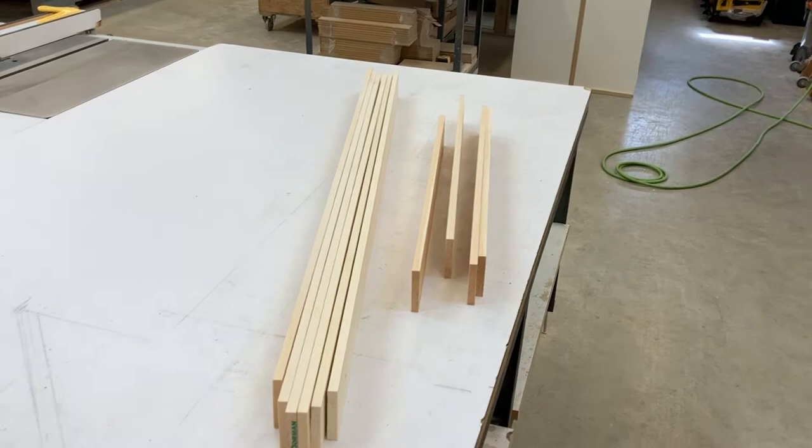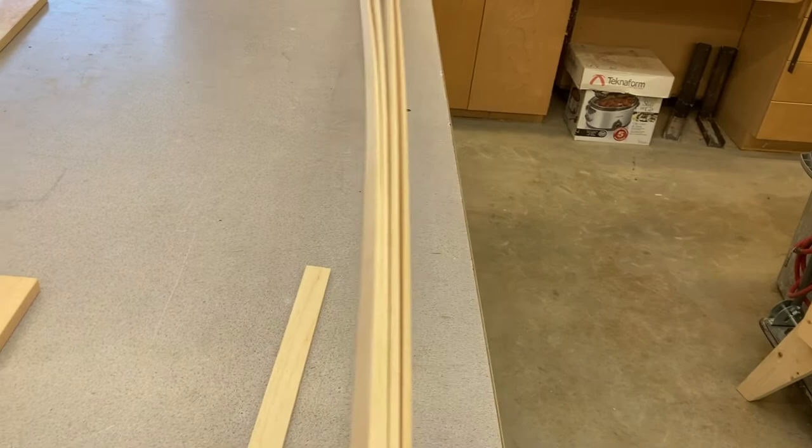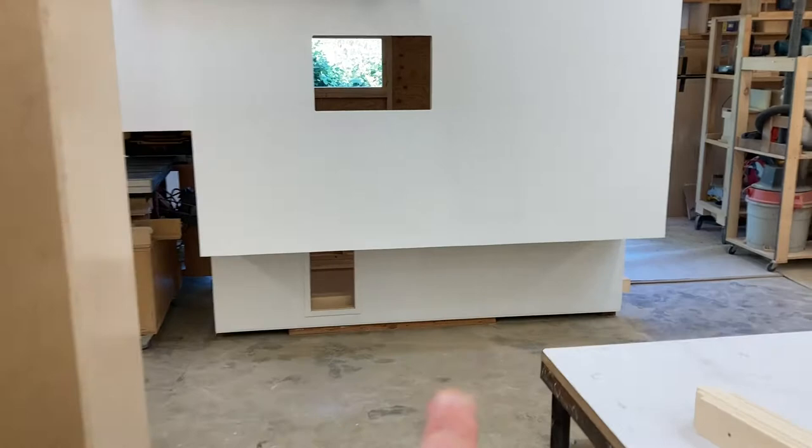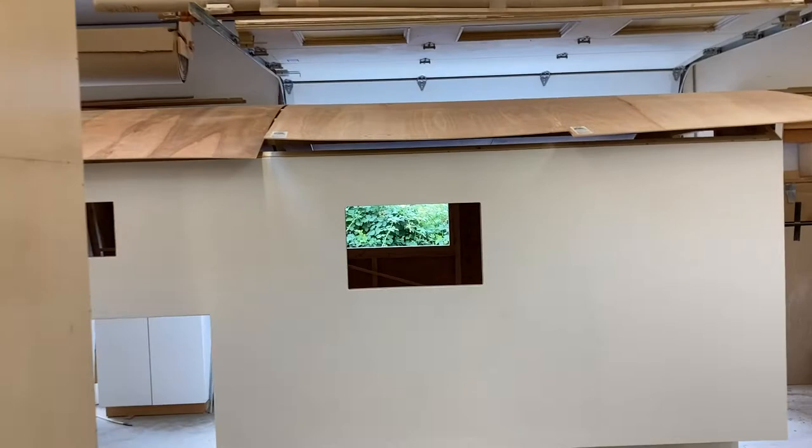There is the trim piece for all the major corners. For the underwings, I've got to mill up a bit more stock — it's about an inch and a quarter by about a quarter inch thick, actually a little tiny bit over. I've got to mill up enough for all of the underwings and then under the cab area. I've also got to mill these strips down to one-eighth of an inch for furring out my rafters, to give a little bit more room for my insulation and also some construction adhesive on both sides.